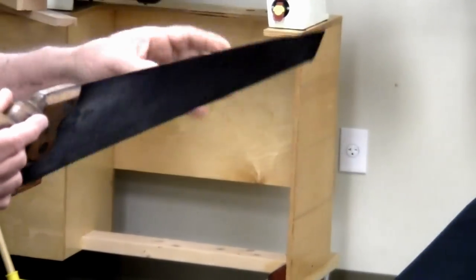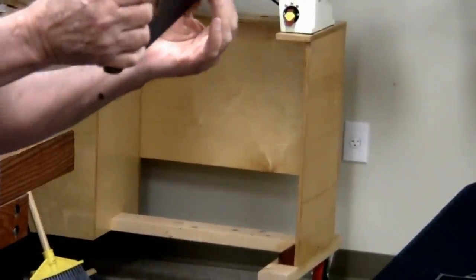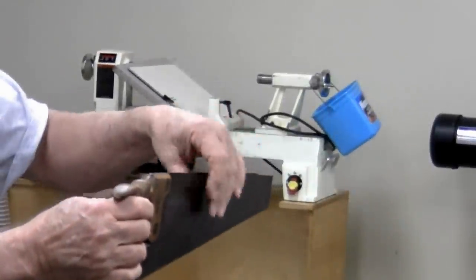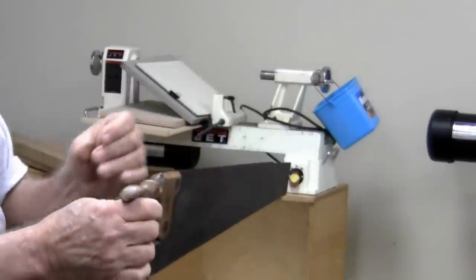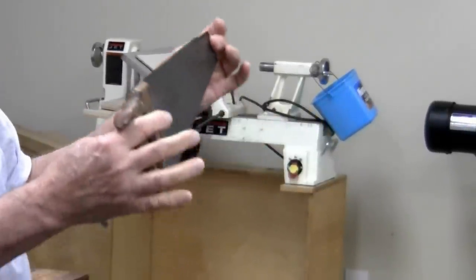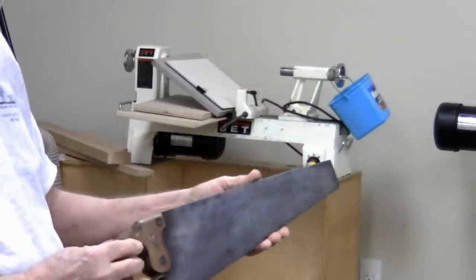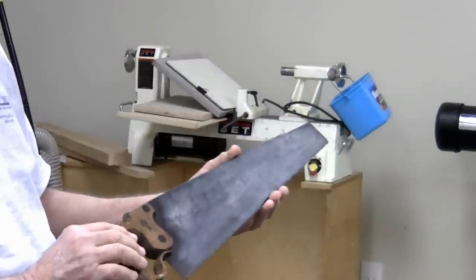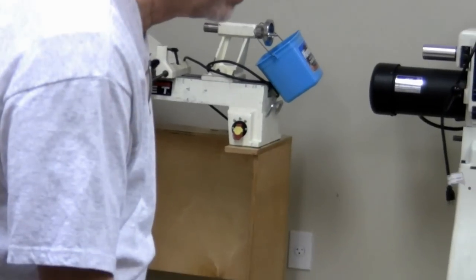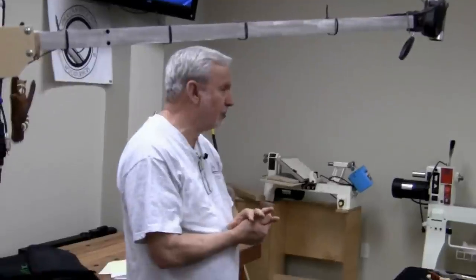According to Henry Diston. And I'll take his word for it. But this saw was hand ground, so it's thicker at the teeth and thinner here. You can actually feel the taper. It's also tapered from the handle down to the toe. 170 years old. This was done on a stone that could be 13 inches wide and up to 7 feet in diameter. And they would have literally hundreds of these things in line in the Diston factory.